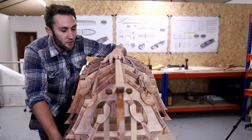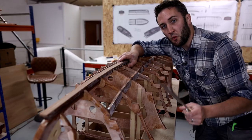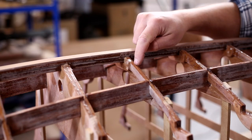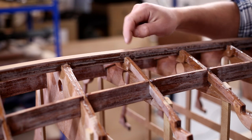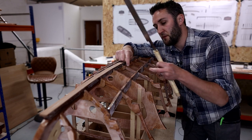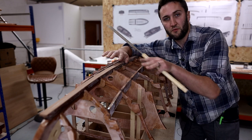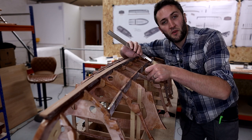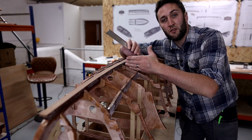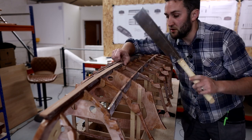We've got a line on either side of the keel as a rough guidance line. Initially we just want to rough down some stock and get the bulk of this taken down, then get to a stage where we're a little bit closer. We're not coming right down to this line yet - we'll use it as guidance to get things fairly close, the same way we did the stringer. We'll also cut a little slot in each of the frames, transposing the line of this frame up and through the keel so that we've got a continuation of this line through the keel section on both sides. I'm going to use a little handsaw to cut that slot on the aft face of the frame - the aft face is our control face as that guides the finished size of this frame, while the forward edge will bevel in.